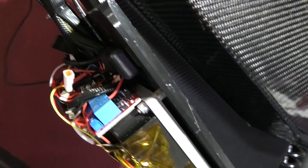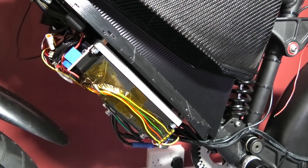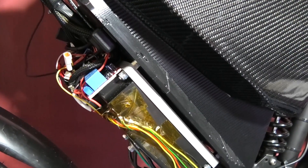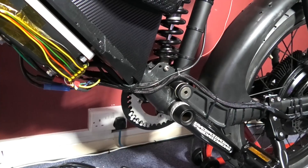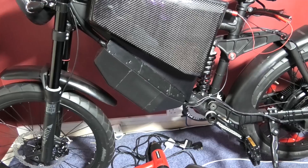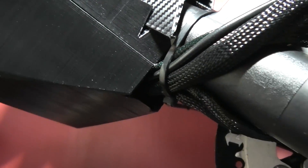The wiring's done, it's tidied up and held together. I'm going to try and get the belly pan on there just to see if it fits. I've still got to do a bit on the Arduino, a bit more programming, and then it's ready. Belly pan's fitted, although I've got to reprint it. Because of things like that I've got to have grommets - anything that goes into an enclosure has to have a grommet around it, and on the back I've got to stop it from chafing.